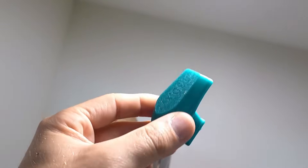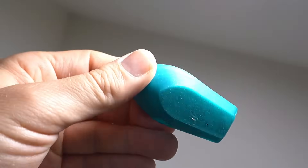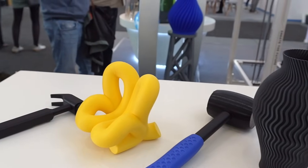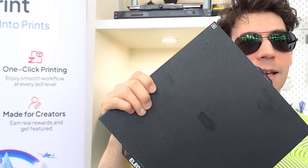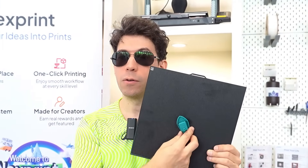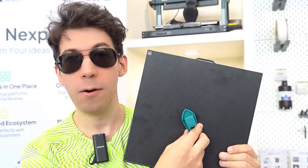I see no particular imperfections, and even in the internal area I found no defects. Returning to printing speed — it managed to create this beautiful boat in just 15 minutes. This model has a speed of 500 mm per second, a maximum temperature of 320 degrees, and 110 degrees for the bed temperature. The textured PEI build surface is really performing well.